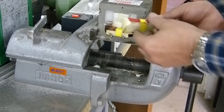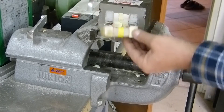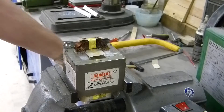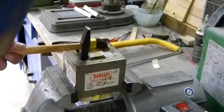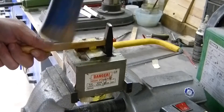You have to be very careful not to cut into the lower section of the transformer — otherwise that's the end of the day. So now we get rid of the secondary coils; we just punch them out with a hammer. Again, be very careful not to damage the primary coils.